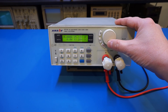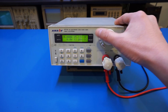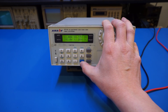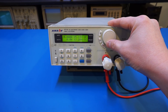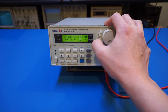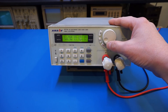Let's see if decreasing the load brings it back on — no, it stays off once tripped, and you basically have to manually re-enable the load. We can re-enable it here. Let's find that limit again: 309 — yes, right there. So 308 is fine. The threshold does appear to be 310 watts. You'll also hear a beeping noise to let you know the unit has entered protection mode.